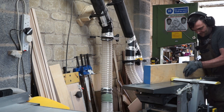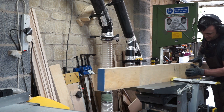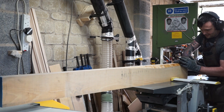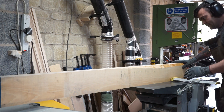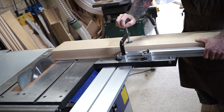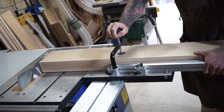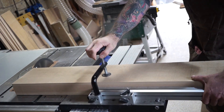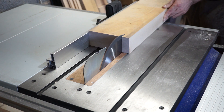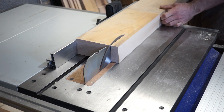Next I plane one edge of each board square to the initial face. I'm using the Record Power PT260 here and there's a review of this machine coming up. It's really not designed for this scale of work though and I did have some difficulties machining this quantity of such large stock. Before thicknessing I trimmed all the timbers for the bench top to rough length and ripped them to rough width, simply to make them easier to handle through the thicknesser and to reduce the workload on the machine. My table saw has a three horsepower motor but due to only having a combination blade to hand and the thickness of the hardwood it was slow going. With a dedicated rip blade this would have been a lot easier.